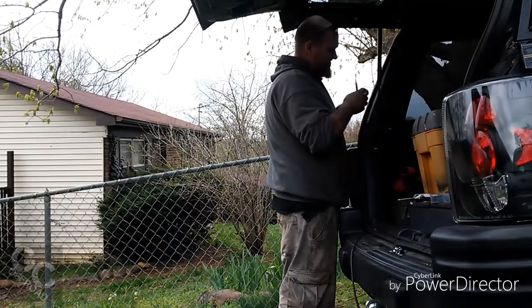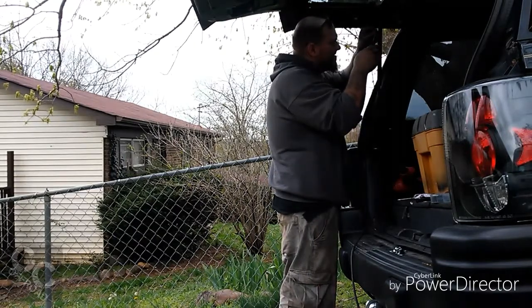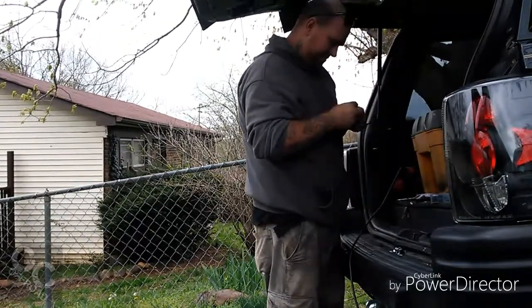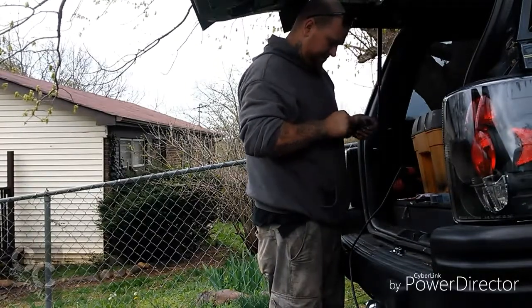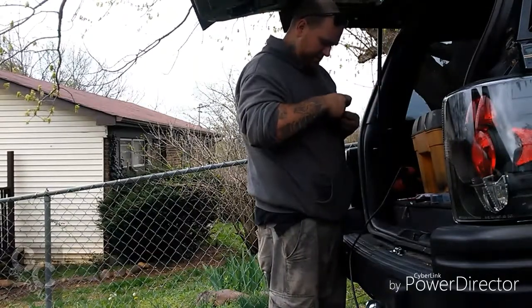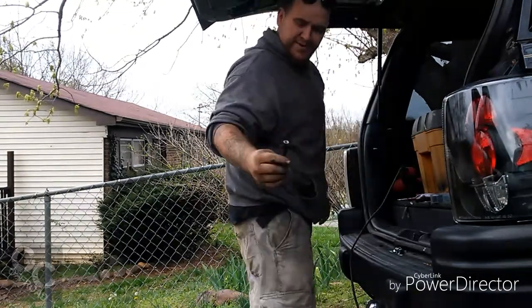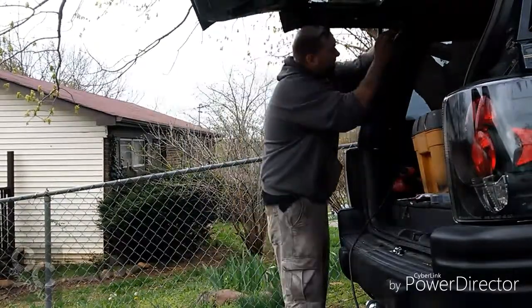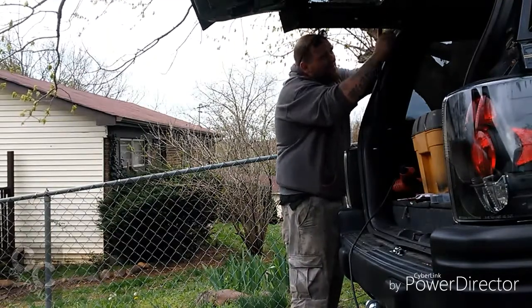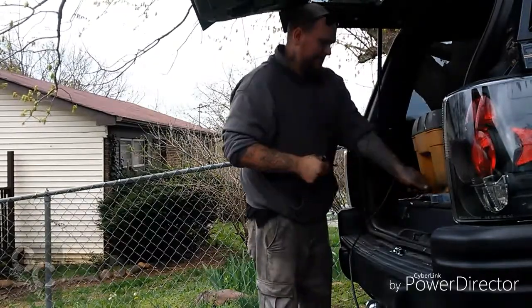Need one of those pliers. So next idea, we'll take a piece of electrical tape, just a small piece, and I'm going to line the washer up on the socket and just make a little rim around it to where it holds on the end like that. Take it and feed it up in here, and when it starts to get a bite on it, pull it off. The tape comes off with the socket, and now I can tighten it down.